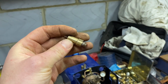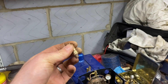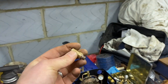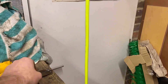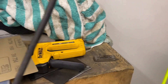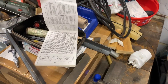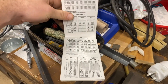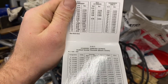So what size is it? It's not a 32 thread, it's not a 26 thread, but it's definitely 5/16ths. So out came the thread gauges, and with a bit of investigation I found it was a 24 pitch thread. So over to the Zeus book, and 5/16ths 24 turned out to be 5/16ths UNF.